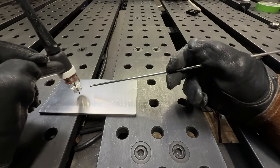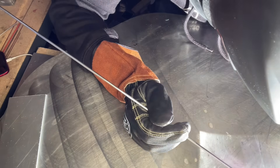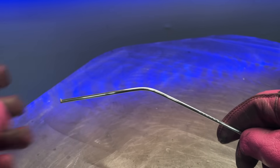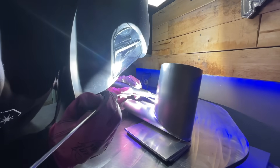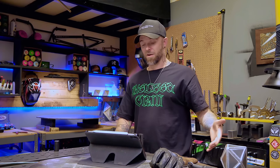This exercise takes like five seconds. Once you get comfortable with feeding the filler material and you're feeding like a pro, do we just say we're good and stop learning? Heck no — there's way more to learn with the filler rod. The next thing I'd recommend is learning how to feed around shapes. I bend my filler material to help feed around corners. You could do something like this around a piece of pipe with one bend or a couple if you have a much bigger radius to go around. It gets my filler rod hand out of my face, I can run longer passes, and I'm more comfortable. This works best when you're working around pipe.